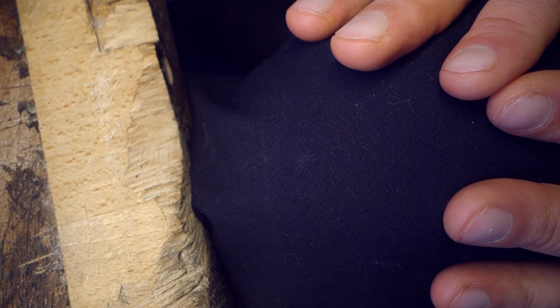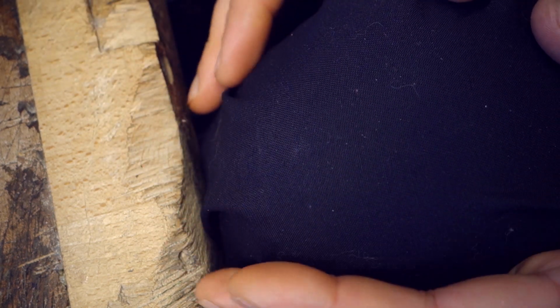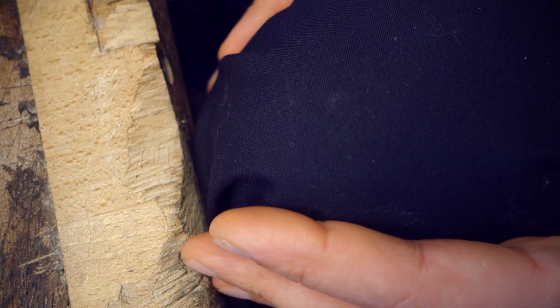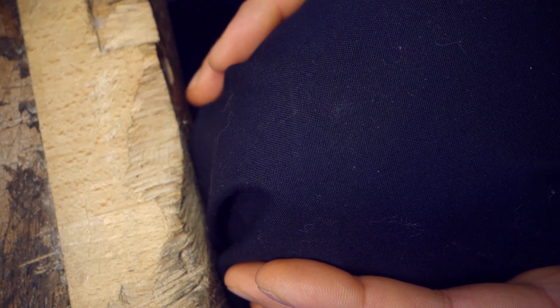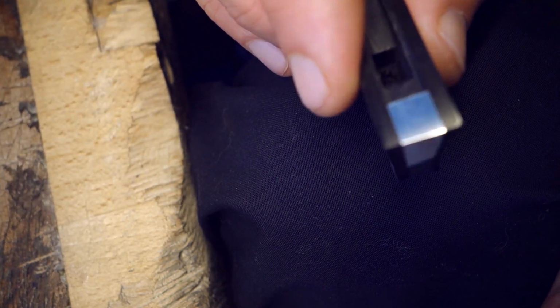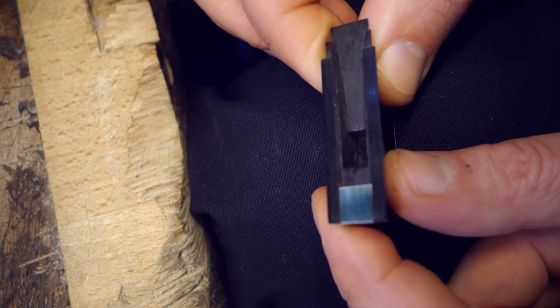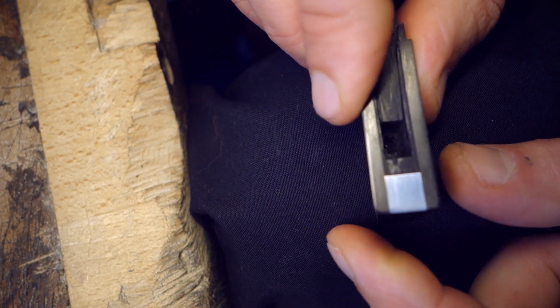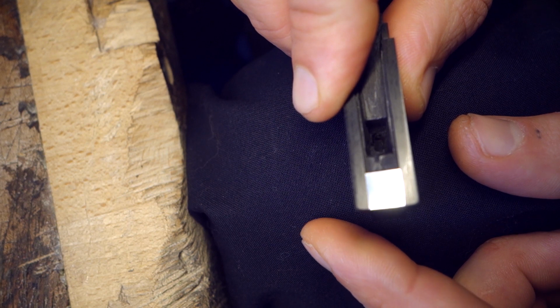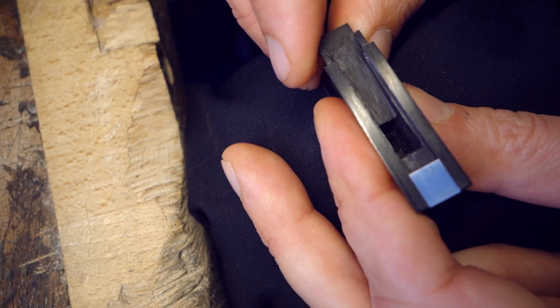One typical Mirecourt and French bow-making technique is to work on your knee. The round shape of your knee gives you the possibility to support a piece at different angles for carving or filing, which you can't do on a flat bench. Also, you have a soft surface that will greatly reduce the chances of damaging the bow, and especially its frog. Sitting on your chair, raise your left knee and rest it against the side of your bench. If the frog touches your knee, it will be only from its brass eyelet. But best is no contact at all between the frog and your knee.